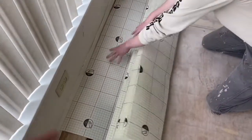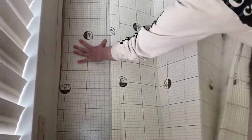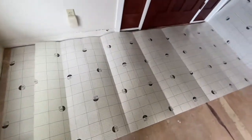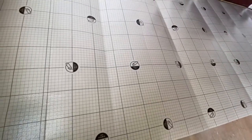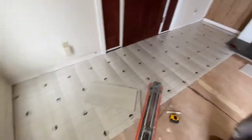Laying out the underlayment is easy — just unfold the first flat with the printing facing up. One guy can stand on one end and pull it, and it accordions right out. Then lay it just like that, pull another piece the same way. Make sure it's tight up against the corners, pin it down with some tape, then use your razor knife to cut it to shape.